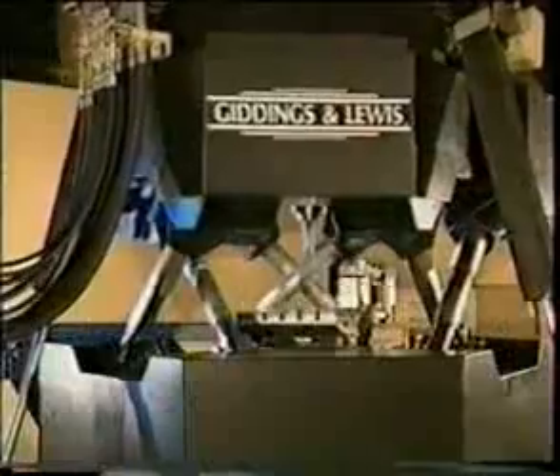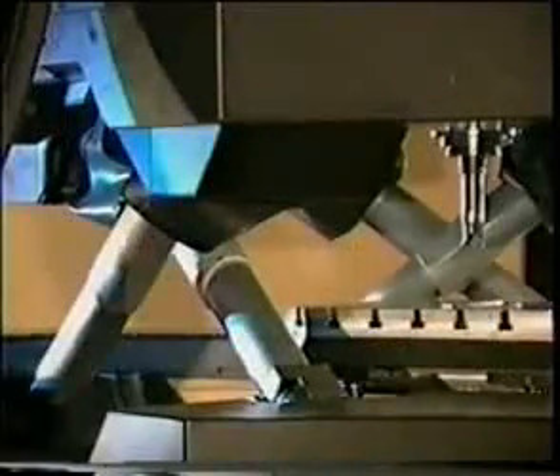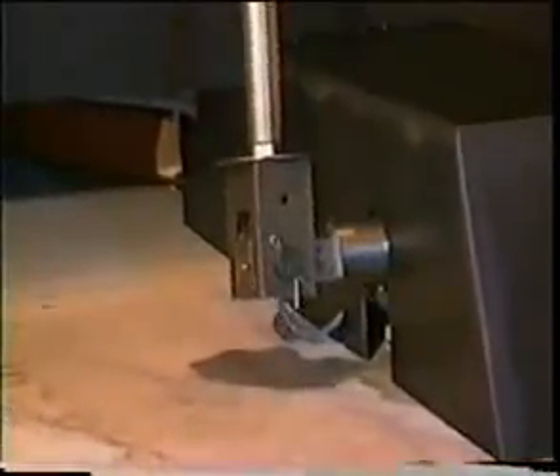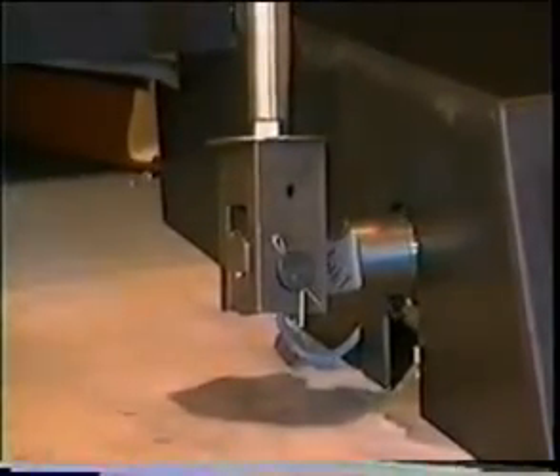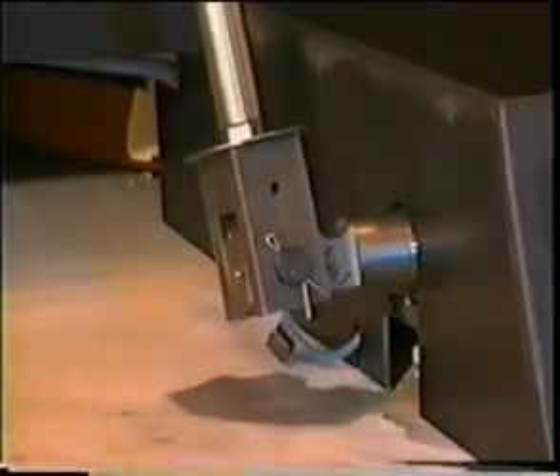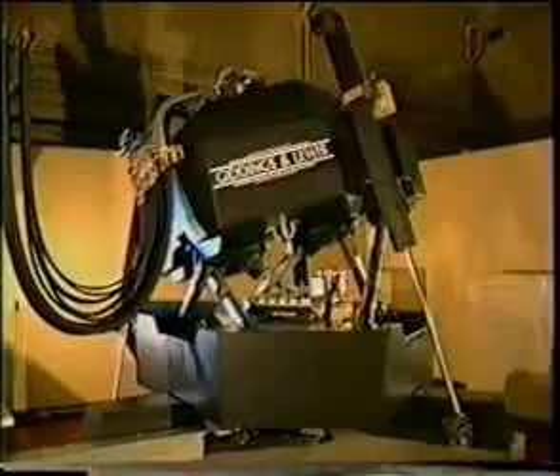Variax is five to ten times faster than a conventional machining center. The speed of this Z-axis move is 2,400 inches per minute. The Variax production model is capable of contouring at speeds in excess of 2,600 inches per minute — and that's contouring, not a traverse rate. Acceleration of greater than one G also puts this machine in a class by itself. With this incredible speed and acceleration, isolation pads act as shock absorbers and isolate the machine from the shop floor. The highly damped compliant mounts lead to improvements in vibration damping, improved accuracy, and increased dynamic stiffness.